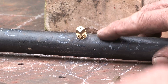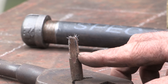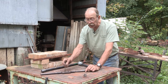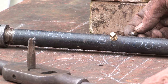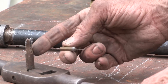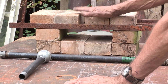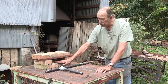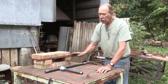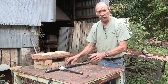I've drilled a hole in the pipe and threaded it with a tapered gas tap. Again, this can be bought at a hardware store, or you can have your gas supplier tap the hole for you once you've drilled it. The orifice drill for the tiny orifice hole in the brass plug and the tap, which is tapered to thread the orifice into the pipe, are the only specialty tools necessary to construct this forge. The working temperature of the forge is around 1800 degrees — at that point the brick is going to be glowing bright orange — and you'll be working your steel at 1800 to 2300 degrees, which is the working temperature for mild steel or low carbon steel.